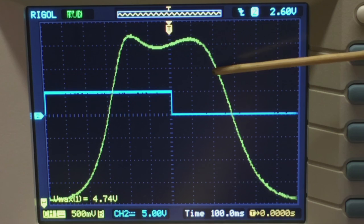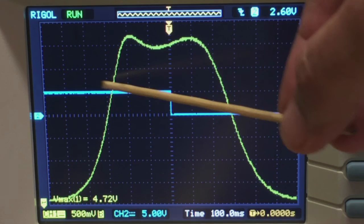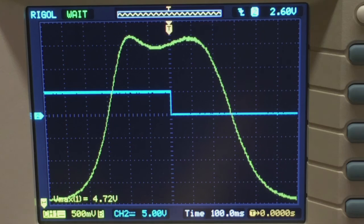Generally, FM will be a better quality audio, and that means you're looking for this bandwidth to get your hi-fi sound, I suppose you'd call it. And that's what we're doing here. We're flattening the top, making it less sensitive, less selective, but making it more quality, okay?